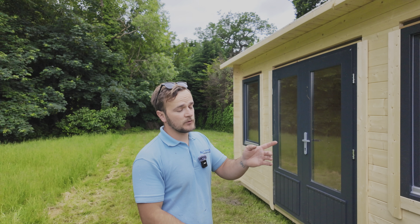Right, so now that Ben has cut the front and the back edge with the circular saw, get them lovely and straight, it's time to put our roof edge support on, which consists of 3x2. Just remember to use something that's appropriately sized, because you've got polytop nails that go through your PVC trims, and what you don't want is them to pop out the back. So 3x2 is perfect for this. I'm gonna zip these in with TX20 screws, 40mm long, 20mm roof board, 20mm bite, sink them 5mm, you'll be absolutely fine. So let's get the roof edge support screwed on, and then we can think about clearing the roof off, ready for the rubber.